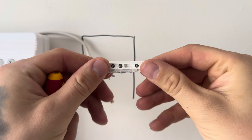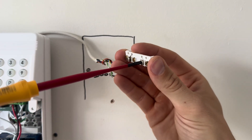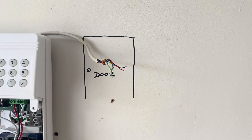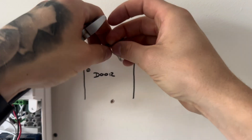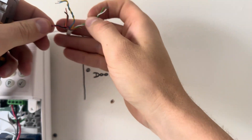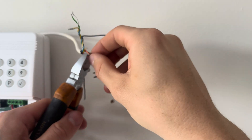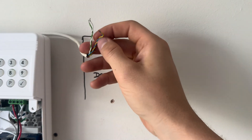Once you've done that, put that down and unscrew the silver screws on your door contact - these are the alarm terminals. Then put that down and get your cable ready. You only need four cores here; you can cut the other cores back because you haven't really got much room in a door contact. So although usually I say wrap them round, it's okay to cut them away on a door contact if you've got four cores in total.